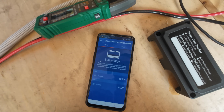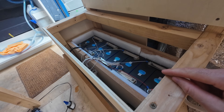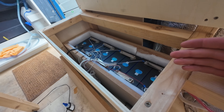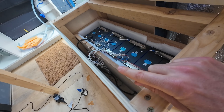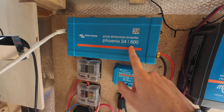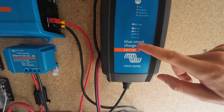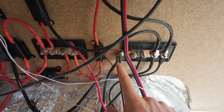Let's take a look at the battery. This is a DIY battery — 24 volts with 280 amp hour LFP cells. These were still about $100 a cell when built, but nowadays you can find them at $55 per cell. This was built two or three years ago with the JK BMS. We also have a Phoenix 24 volt 500 VA inverter, a converter which converts 24 volts to 12 volts for lighting circuits, the fridge running on 24 volts, a Blue Smart charger at 24 volts 13 amps, and the shunt mounted here.